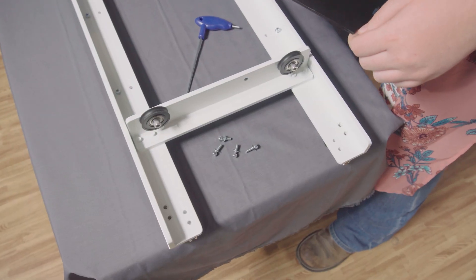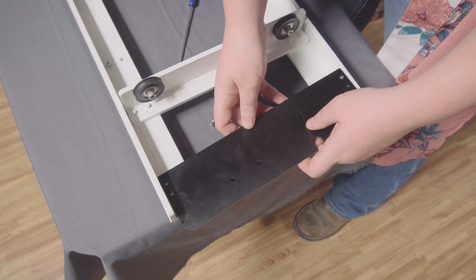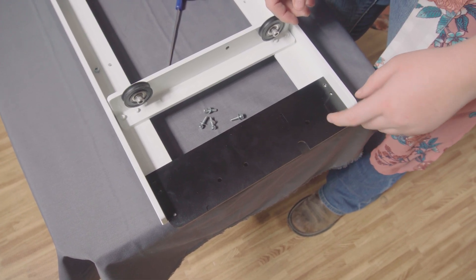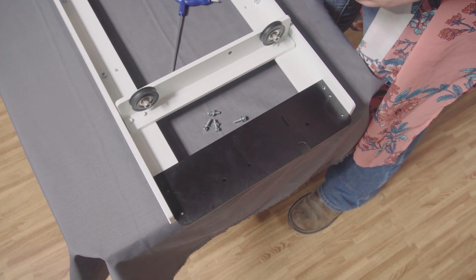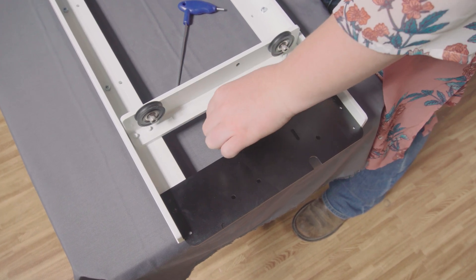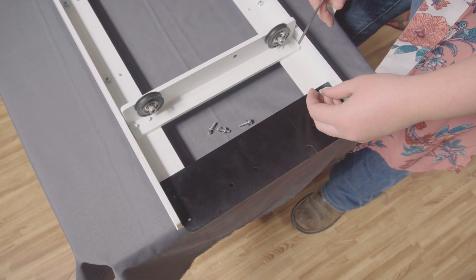The Butler robot mounting bracket has mounting holes that match with the holes where the screws go. Line the bracket up with the holes. Make sure the U-shape cutout on the bracket is closest to the edge of the carriage where the stitching encoder rides. If the carriage is right side up and you are facing it from the front, that would be the left-hand side. Using the same screws that you removed from the carriage, you may now attach the bracket. Be sure not to over-tighten the screws.